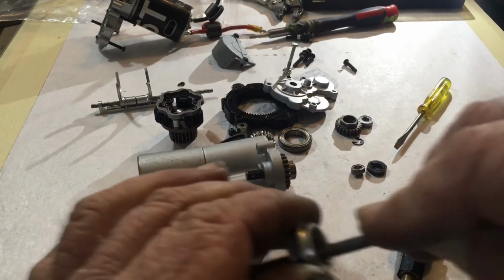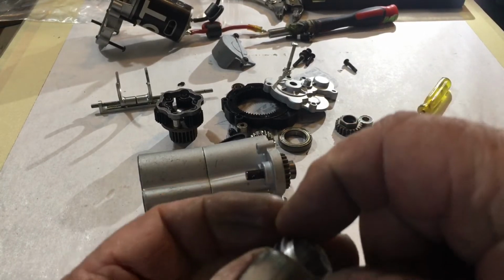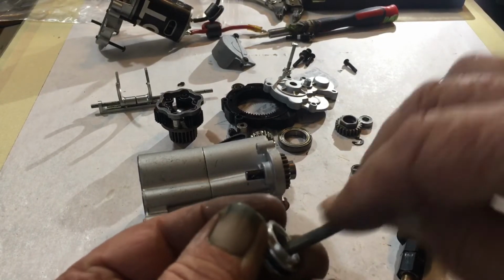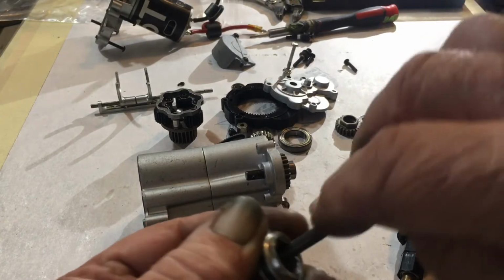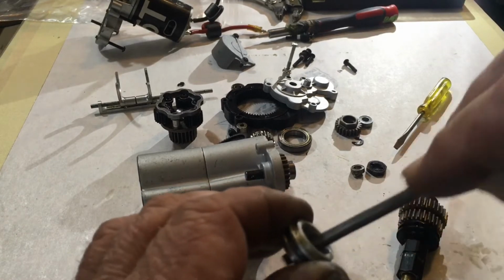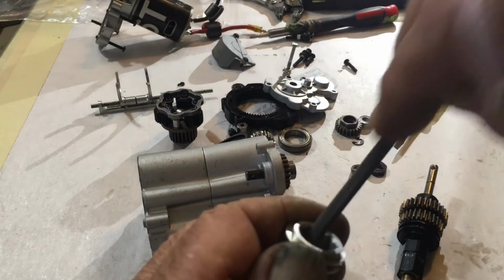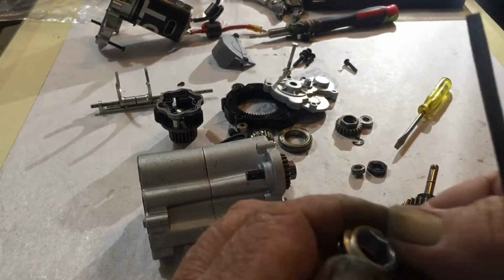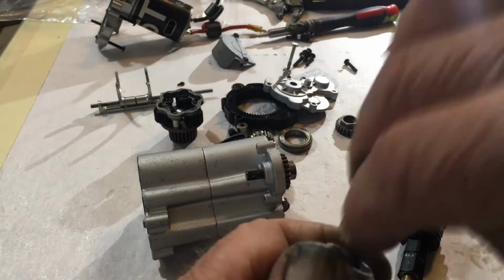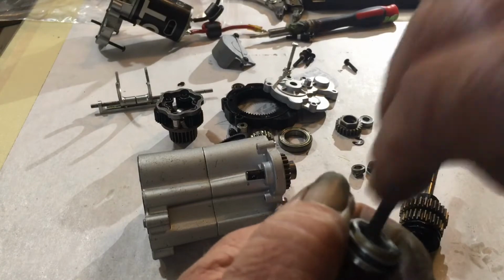It's almost like they were in such a hurry to slam them together, or they missed a step when they were making these things. Okay. Get all 6 sides done on one side, turn around, do the other side. What this does, it lets the collar slide over the hex a lot easier, because there's a little rough edge on these when they make them.